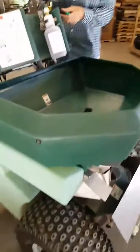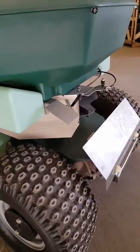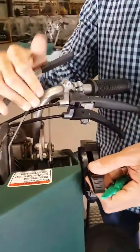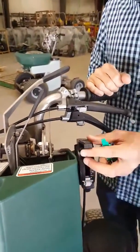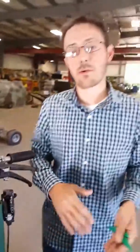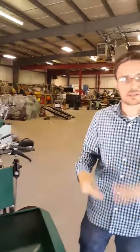That was one of the reasons why we put the deflector lever and the third hole lever right next to each other right here, so that when you pull back on this and put that deflector down, you want to also pull back this third hole lever in conjunction with it. Because if you do leave that third hole open, it will start shooting heavy to that right-hand side, and you'll get it heavy right by the tire, and you can potentially get some streaking there.